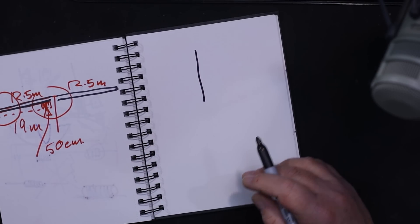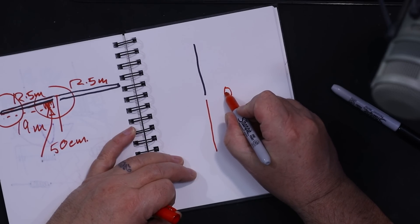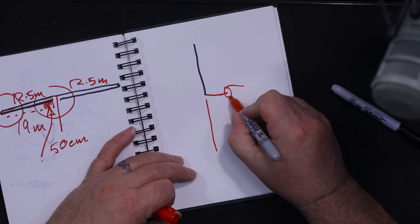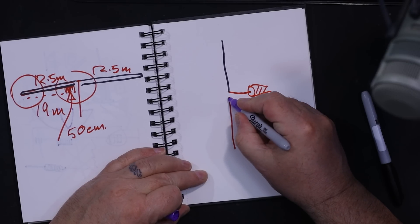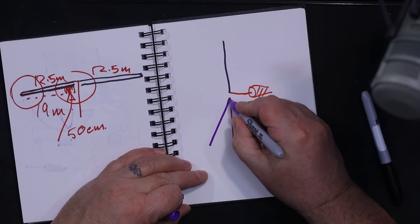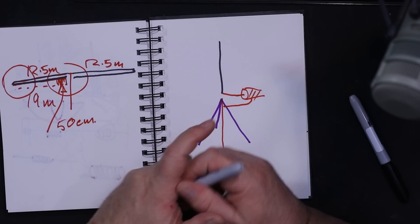Effectively what we have on the screen here is a dipole, where you've got the coax coming in — one end goes this way and the braid of the coax goes the other way. You put that up in the air and you end up with a better match if you design it to go straight down, then put three radials at about 40 to 50 degrees. That doesn't really matter, but you end up with a great match to 50 ohms.